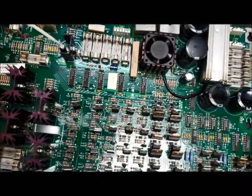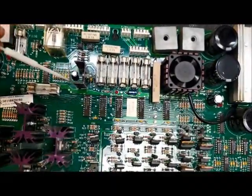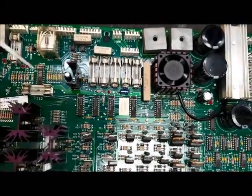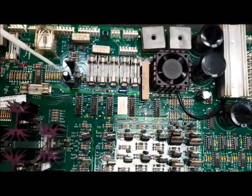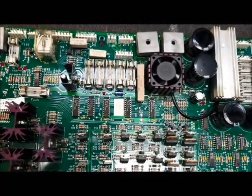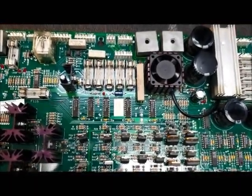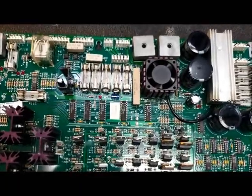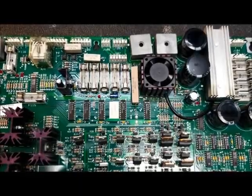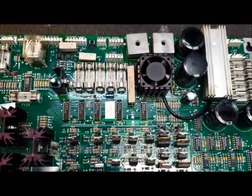What I've found on these: when this capacitor goes bad, notice how it's built real close into this heat sink. Well, these boards sit vertically, so that's up, and the heat can trap in these things. When that line gets ripple in it — and it gets a lot of ripple when that cap goes bad — you get really weird switches that just go off for no reason, but they're all on the optos. So if you have optos that just trigger for no reason, trigger when they shouldn't, that's the probable cause.